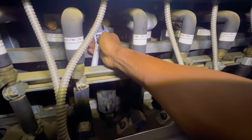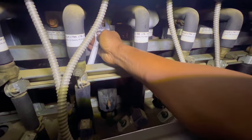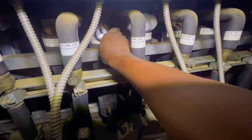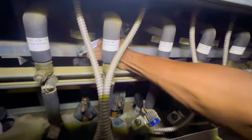Alright, I'm gonna close the suction. I'm just doing this to be on the safe side. I know most people don't have to do that. Now, it's just that one little line. I probably could have wetted it up quick, but why not? And it looked like that big suction line ate through the cap on the suction line. Just gonna try to use access to that port down that way.